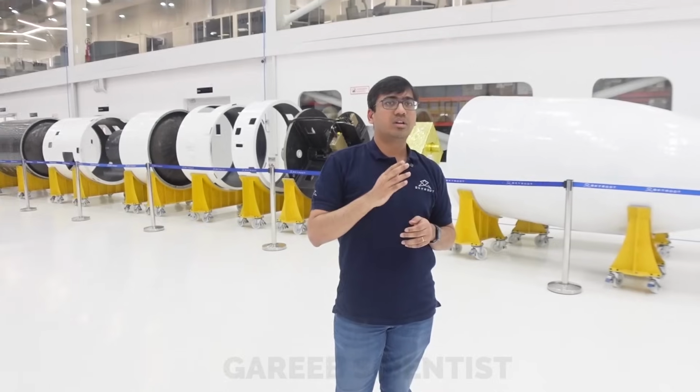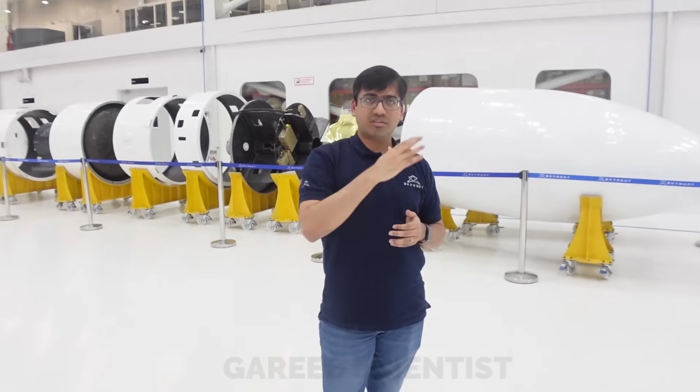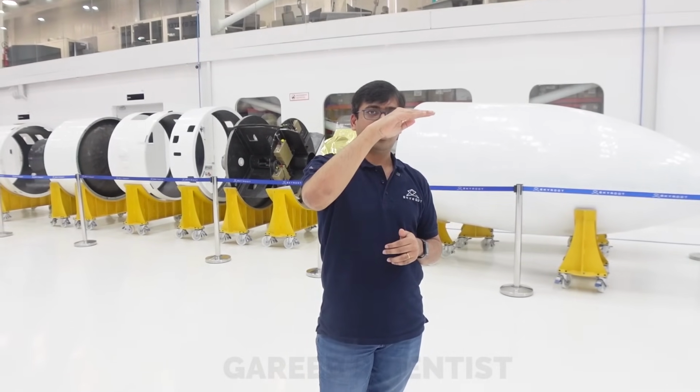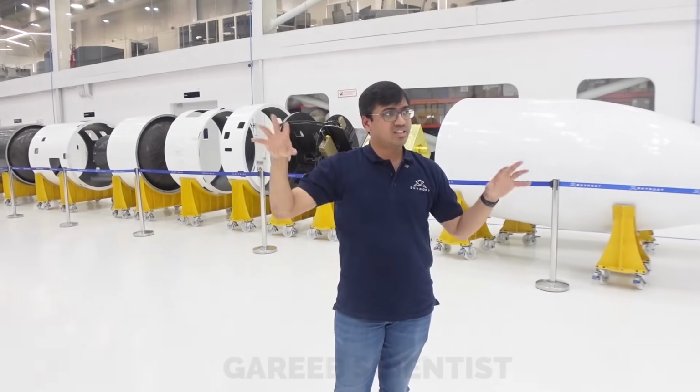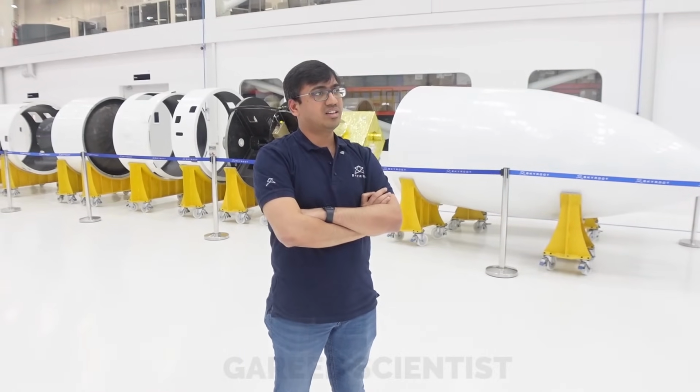So what we do is that initially before reaching max Q, the thrust goes down, so that our Q comes down. Q is dynamic pressure, max Q is maximum dynamic pressure, and so overall max Q during the flight also comes down. So we have a thrust which goes up initially and then comes down just before the max Q regime. After that zone is passed, again it goes up. So we design the curve such that you have very little overall stress on the vehicle.